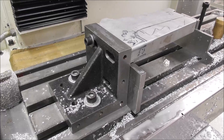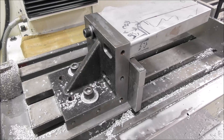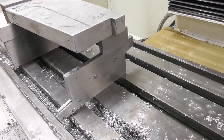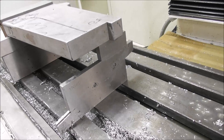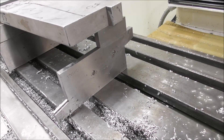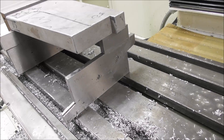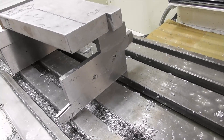I've got several angle plates of all different sizes and I just put slots and tapped holes in them as needed. It makes me cringe a little bit doing that, but they really need to be useful devices. These adjustable parallels are really useful — if you haven't come across them before, have a look online. You can buy them in sets; it's a good idea to get two sets so you can make matching pairs. Just slide them into a preset micrometer and you can have exact parallel pairs of any size. They can also be used for medium accuracy work as slip gauges for a lot of applications, so if you can't justify the cost of slip gauges and don't need the precision, you can set these quite accurately with a micrometer.